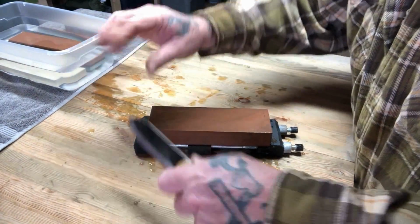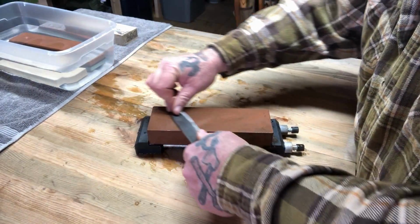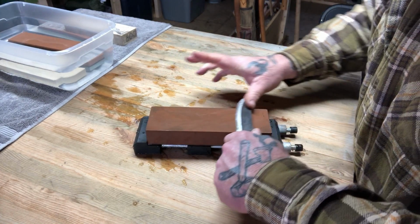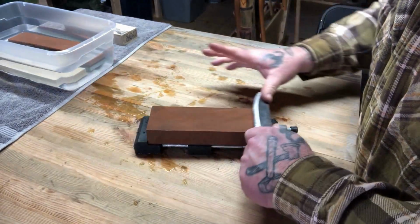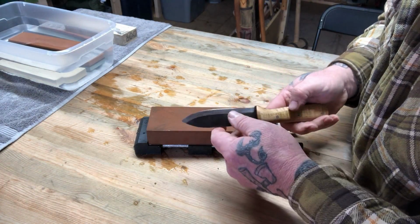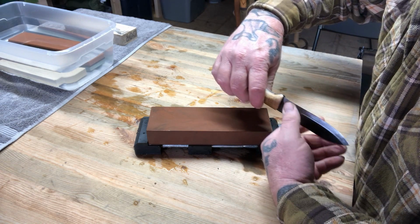You get to the point where you can register that bevel every time without necessarily having to go perfectly flat and raise up to it. You'll start to get where you can feel where that bevel's supposed to be. Every once in a while, just wipe it off and kind of look and see where you're at and what you're getting, and see if you're getting it any thinner where you wanted to get it.